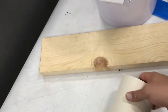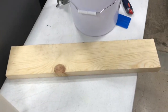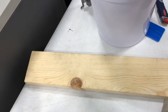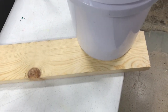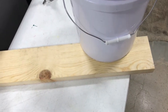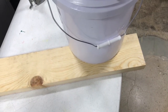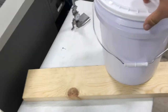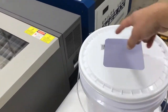What I've got here is I just got done building a big table, so I've got some leftover lumber here, and I'm just gonna do this quickly. I'm gonna cut this in half, and then cut this in half, and then set this right in the middle. I'm gonna trace around this bottom part on the wood, and then it's gonna contour, and I'm gonna screw from the inside, because when I take that top off, I'll have access to it with the drill. That way I'm gonna have 2 flat surfaces to just place this in. It'll give it some bottom weight so that it doesn't roll over when the birds are in there, and it also keeps it square to this opening.